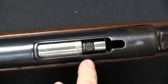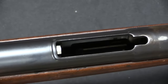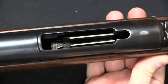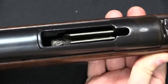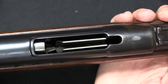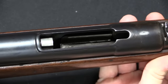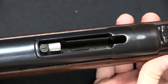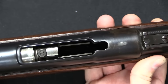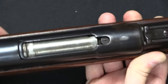The bolt itself is a rotating locking bolt, so you can see as I'm sliding the handle back and forth. As you move it backwards, what it does first is rotate the bolt to unlock, and then slides it rearward. We have a pair of locking lugs up here that are what actually engage and lock the thing. Once it goes all the way back it's going to pop up an elevator. This thing is actually split, so you would have a cartridge held inside it, and basically the lips of this thing wrapping around the top prevent that cartridge from going anywhere. When the bolt comes forward it is going to split that open — there's an extra follower piece that's going to split the elevator in half. At that point the nose of the cartridge has gone up into the chamber and the back is being pushed by the bolt, so as this chambers the elevator drops back down to pick up the next cartridge. That is rather like a Henry-pattern elevator.